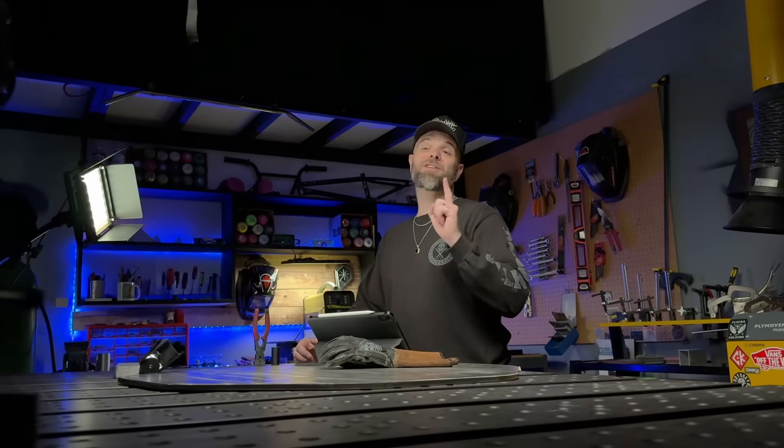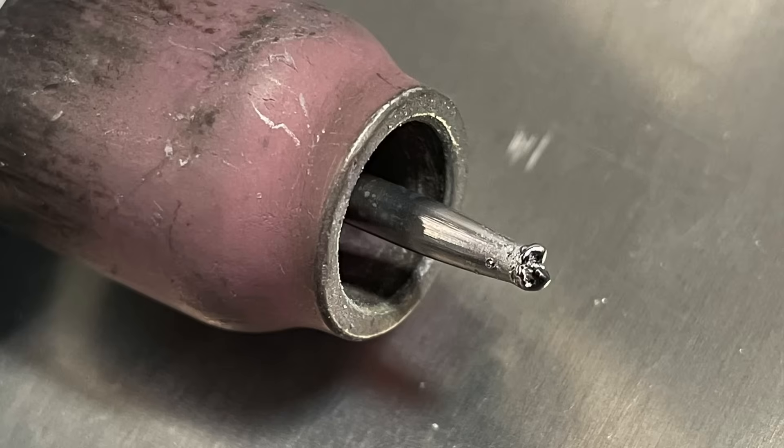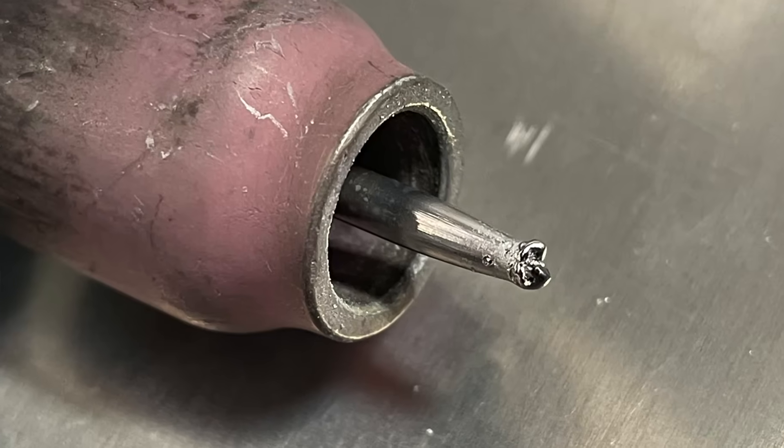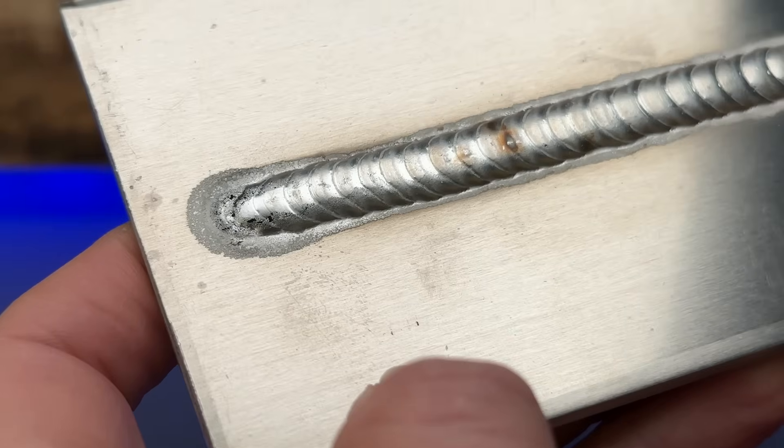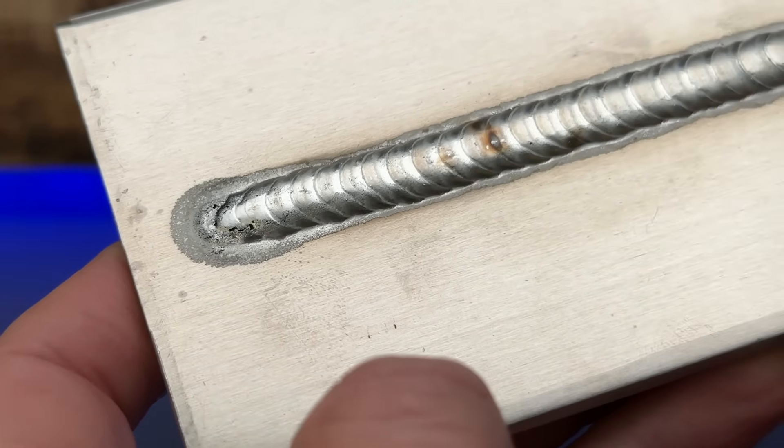Next up is balance. Too much of the positive side — the cleaning side — and you'll see the tip of your tungsten wobble around and look unstable. This happens no matter what tungsten preparation you're using; your accuracy goes to hell and your welding looks terrible. Too little of the positive side and the weld becomes sandy or grainy — you'll lose a lot of its shine, essentially still covered with the oxide surface on the aluminum.